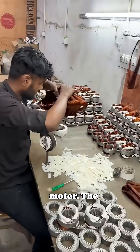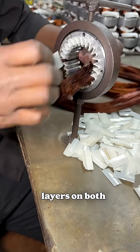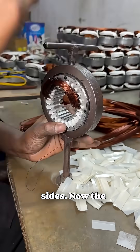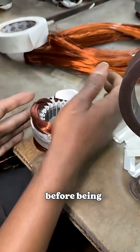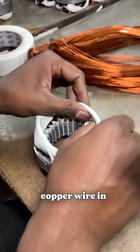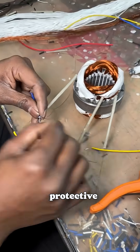With the coil ready, it's time to assemble the motor. The stamping is placed on an iron ring and the coil is carefully fitted between the paper layers on both sides. The wire ends are pulled out and kept separate. Now the motor is complete with its perfectly placed coil. The coil is secured with paper tape on both sides before being tightly stitched to keep every copper wire in place. The exposed wire ends are threaded through a thin protective pipe to prevent rust.